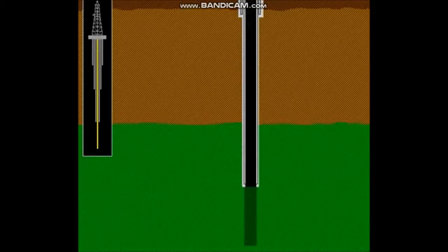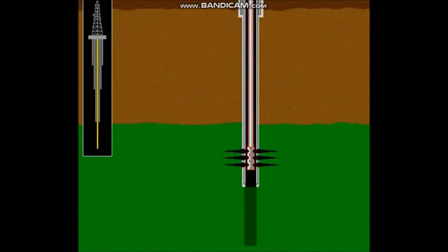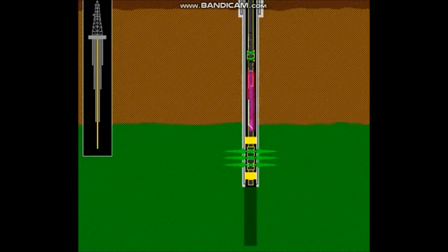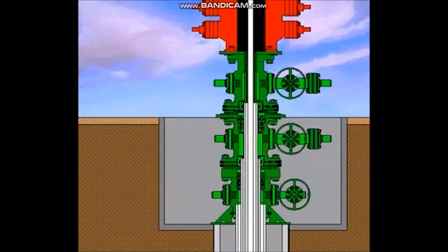When the plug has been drilled out and a clean-up trip completed, the perforating gun is run in the hole and the casing is perforated, or shot. The down-hole packer assembly is run and installed in the production casing. A packer is in essence a seal assembly that isolates the reservoir from all strings of pipe except the production tubing. The production tubing is run with a bottom-hole assembly to seal inside the packer. After the tubing is spaced out and proper weight set on the packer, the tubing hanger is installed at the tubing on the rig floor, then lowered into the bowl of the tubing spool.